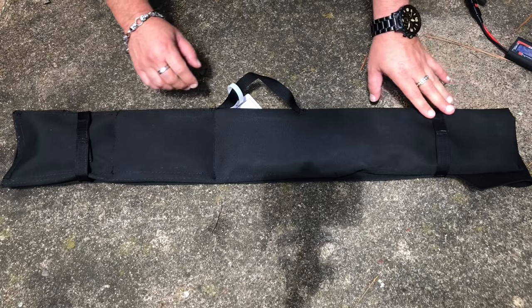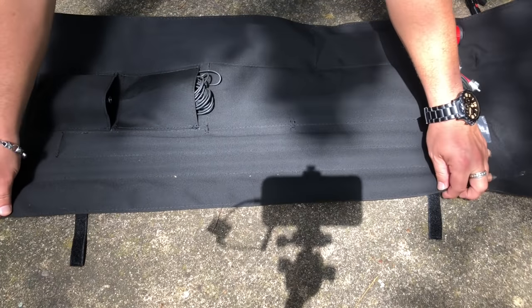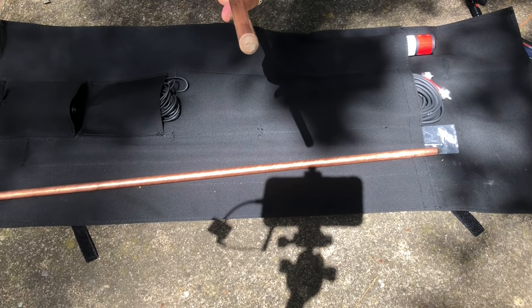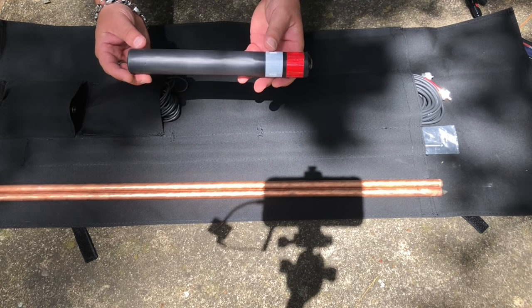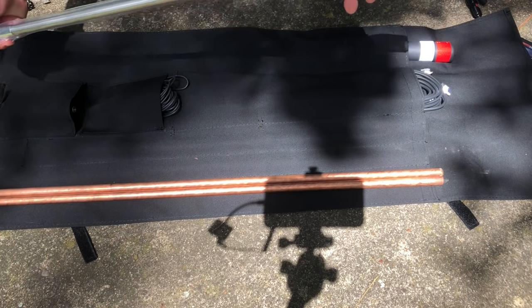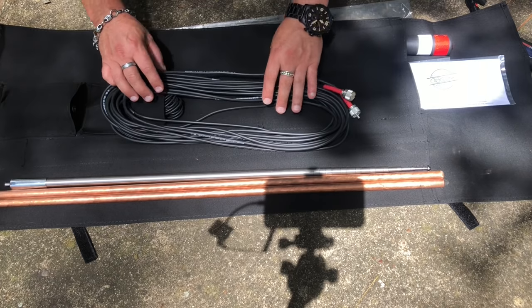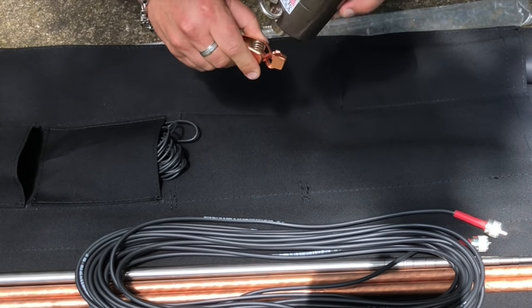This is how the antenna comes. It comes with this nice carrying bag, some nice Velcro straps to keep it all secure, and it just rolls out and you've got literally everything you need other than your radio and your battery in this bag. We've got two big, ginormous ground rods — these are solid, thick, heavy hunks of metal. We pound those into the ground with this little slammer device. It's got some nice reflector tape, so if you're out in the dark and you drop this, you can shine a flashlight and find it. We've got a 17-foot telescopic whip. Comes with 50 feet of some really nice RG-58 from the Wireman — some really nice coax. Here's the actual transformer itself with a ground strap.